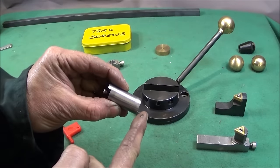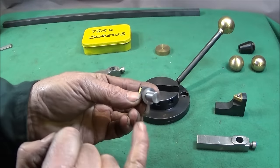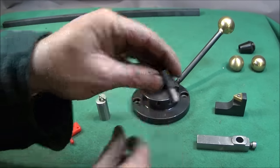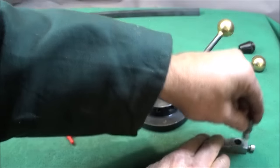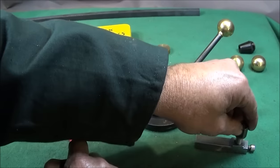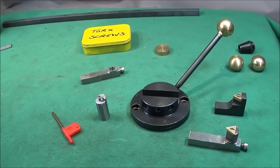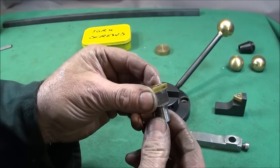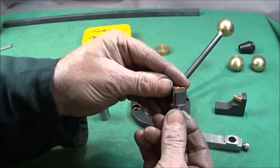So to finish off, it's finished turn the diameter to fit the lower half, like that. And like I explained earlier, leave that plus. And then you can put the ball turning attachment on the machine and keep machining that shoulder there until you've achieved the exact center height for your machine. And then I put it back in the milling vise on the lathe and machined these two angles off to give it clearance.